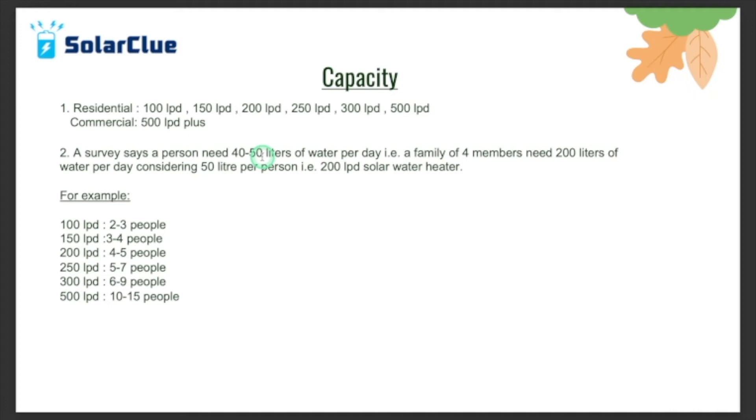Whenever there is a range, always go for the higher one, because the solar water heater capacity remains fixed throughout its lifetime of around 15 years. Also note that the unit is LPD — litre per day. So if you buy 200 LPD, the product gives you 200 litres per day every day for 15 years. If today you have four members, 160 is okay, but what if the number of people increases — newborn kids, older parents, guests? Your requirement will become high but the solar water heater output stays fixed. So for future purposes, buy a higher capacity now.